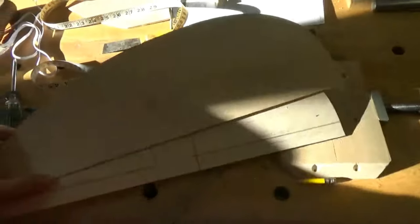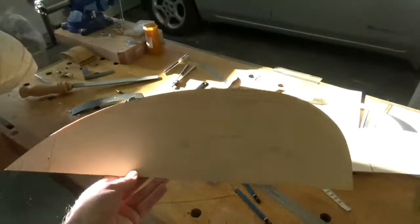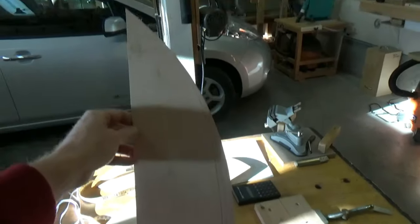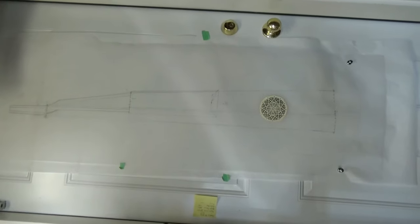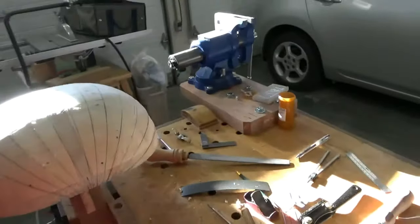To mark out the mold in the first place I used these templates. There are two templates. One is this template that's the whole outside profile of the lute, and then here is the back - this middle board right here is this section here. You can see I have a line drawn on that piece that shows the comparison. So this lute is extremely flattened. And over here you can see I've got a drawing that I made of the lute - it's a design I've just kind of cooked up. After making lutes for 35 years you can just sort of decide what you want to do, maybe based on practice. And that's what I've been doing today.